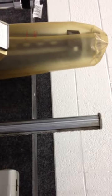It just moves a lot. This thing's got a huge nick in it. It's so hard to get this in there. At what point do you realize the measurement? When you don't have nicks, it's real easy. Yeah, this one's got a serious nick in it, and that is not flat. You could stone it, make it easier on yourself. You got a little stone? Yeah. Just hone it out and get that burr out of there, because I'm sure there's more than one.